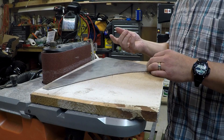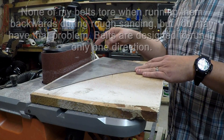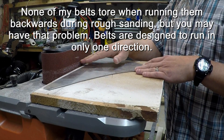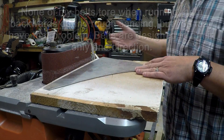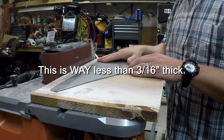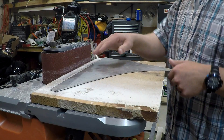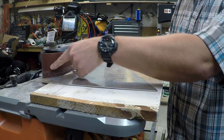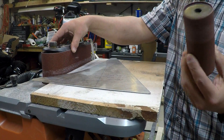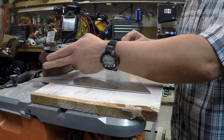What I'm going to do is use this half inch or three quarters of an inch of the belt until it's loaded up completely, and then despite what the directions say, I'll actually flip it around for this rough sanding. I'm starting with 80-grit paper, and you don't want to go too long with 80-grit because it leaves sanding lines across the work even on material that's only three sixteenths of an inch thick. I'll do some finish work with 240-grit afterwards. You can also do inside curves against the sanding drum - I actually wish I had a three-inch drum, but I've got a two-inch drum and can use that for inside curves.